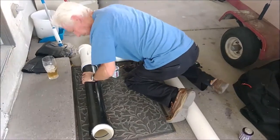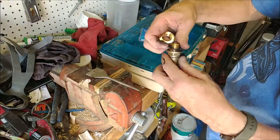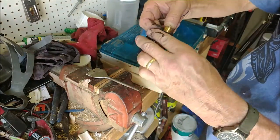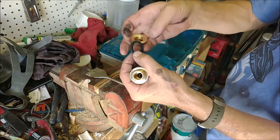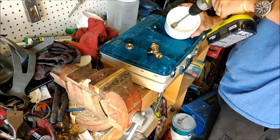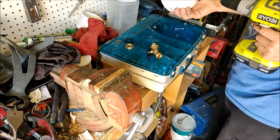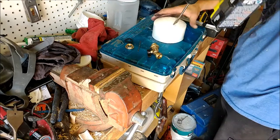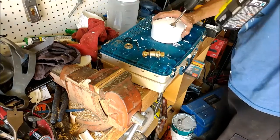What's really key to make that valve work so well is this big rubber washer that it comes with — it's made for rain barrels. To drill a hole in the end cap I just used a wood paddle bit, and it works great on PVC pipe. Who'd have thought — it works just fine.